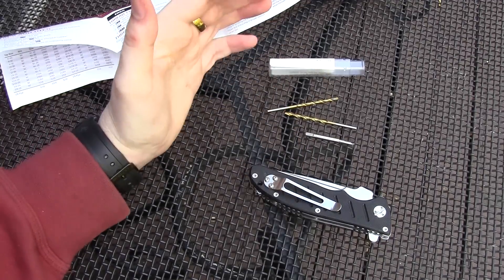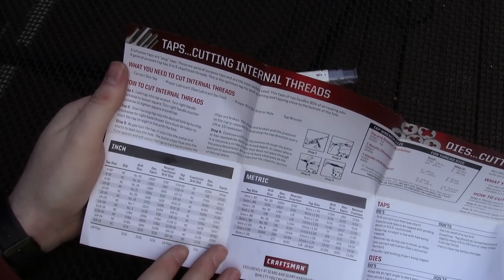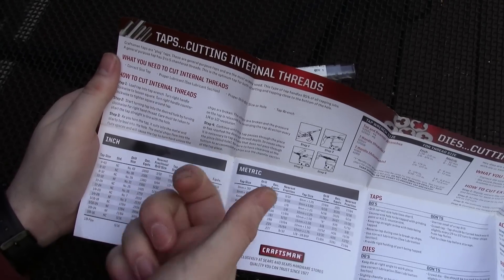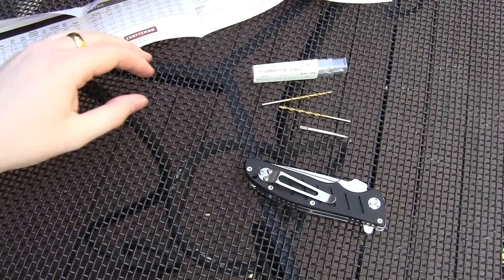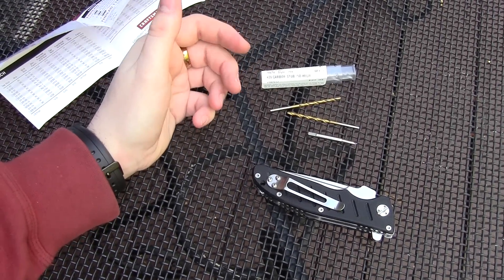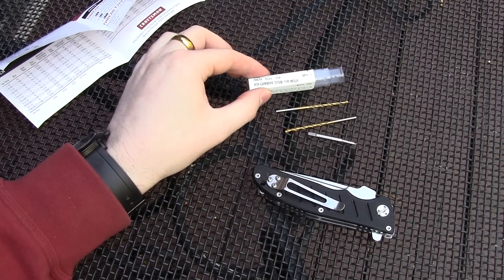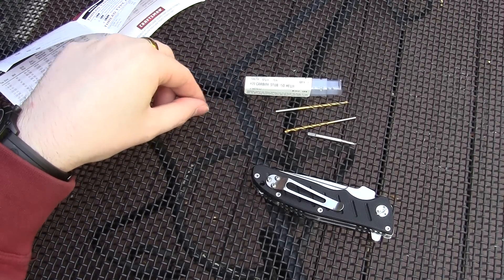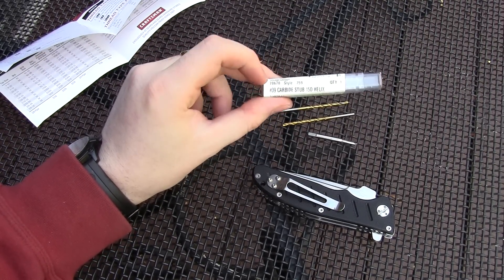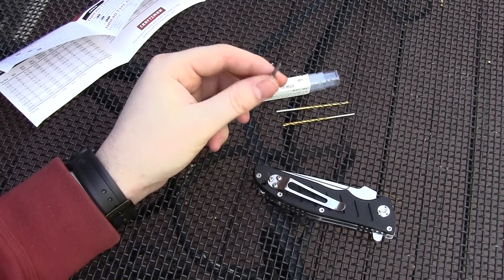I got it done, but I'd love to know what went wrong. I'm pretty sure I was doing it right — I followed the instructions, I was using oil, I was breaking off the chips by turning backward every little bit. It just did not work with the drill bit size and tap size listed on the chart. The hole was probably about 90% of the size it needed to be. I had to work it up through three sizes until I got something that worked reliably without risking breaking the tap.